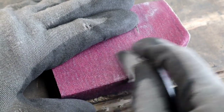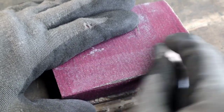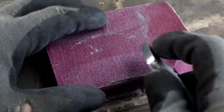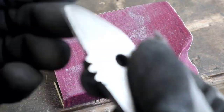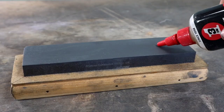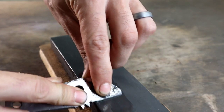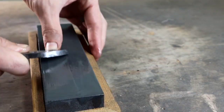Now that the faces have been sanded smooth, it's time to work the blades. I need to take the pitting out, which is a risky move because these blades have a fixed point. You run the risk that they'll no longer match up correctly, leaving you with two options: drill out the holes in the jaws and shift them over, or cut down the stoppers. Unfortunately, the previous owner chose the latter. I ended up going down to a 60-grit to work out the nicks, then brought it back up to a 120-grit. When working on the stone, apply some honing oil to protect the stone and carry away the debris — though it turned out the blade edge is magnetic, so the metal just stuck on the end. Make sure you even out the area of use on the stone and prevent any low spots the best you can.